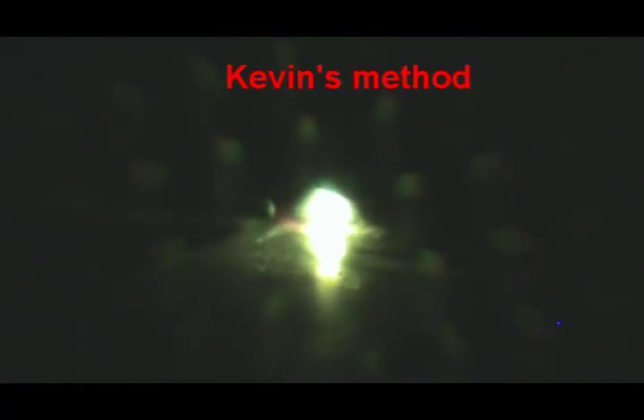Now let me show you the way I do it, where I just kind of pull my rod along in front of my weld. Now I get my puddle started — you can see the rod get molten right in front of it, and it just pulls the metal in as it needs it.